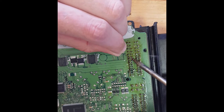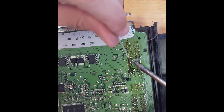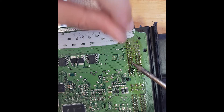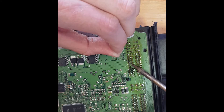If it looks a bit flat, put a little bit more solder on it — because like I say, these do have to connect on the opposite side of the board also. Not all of them do, but if you get one that needs to be soldered on that side and it isn't connected, then you're going to have issues.